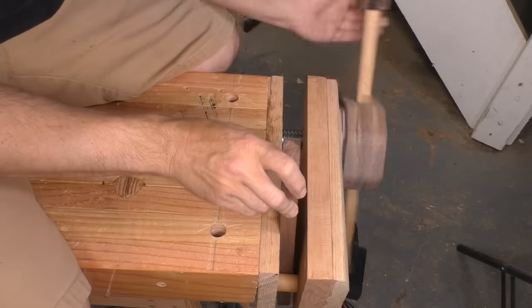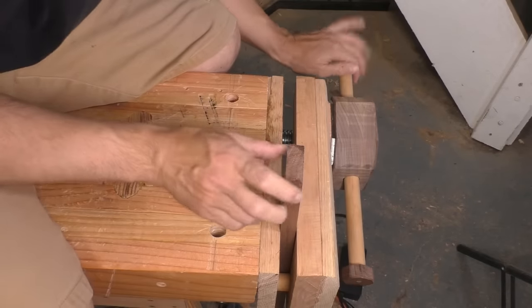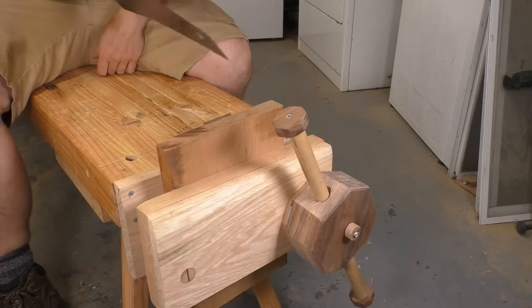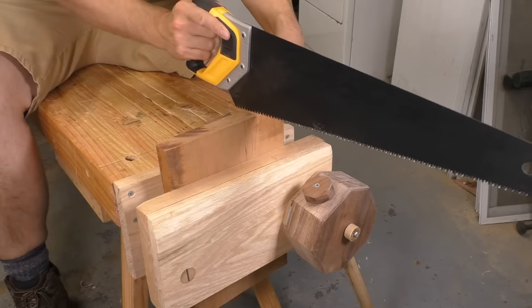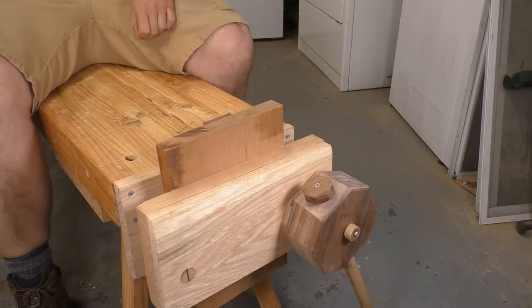I should also mention one other detail I just added to the bench. I find it very convenient if the handle is centered about halfway on the hub — that gives me basically two places I can grab it and spin that thing really quickly. But occasionally, having the handle in that orientation leaves it sticking up where it gets in the way of my tools. So I just added a screw stuck to a little piece of dowel and drove that through the center of the hub. Anytime the handle is sticking up and in my way, I just reach down and give that dowel a little twist and the handle drops right out of the way.